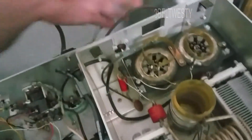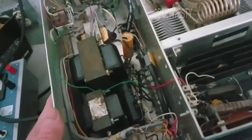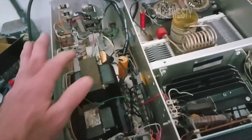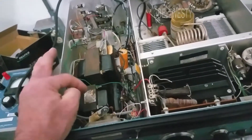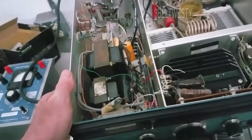Normally it's got an 8873 here with a big heat sink. There's no fan so it probably broke and then all this stuff happened. Normally there's a giant power transformer here for the high voltage and caps. With the tetrodes you've got an extra grid in there - that's why there's an extra transformer on there. One of these is probably the filament for the tubes. I think there's an extra high voltage here because you've got a cap here. It's one of these things - I need to bring it up slowly and I can see what's going on. It's got two relays here.